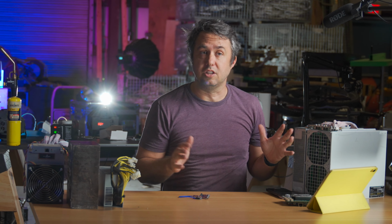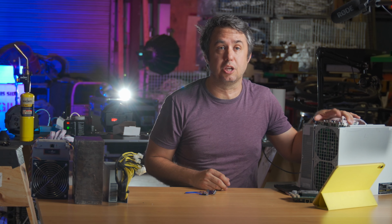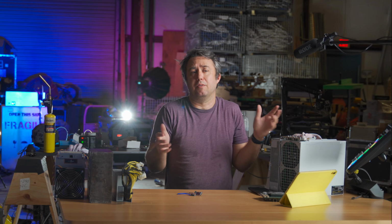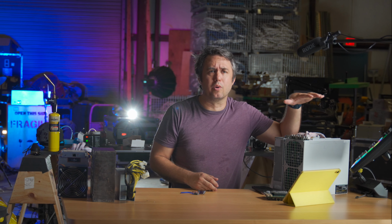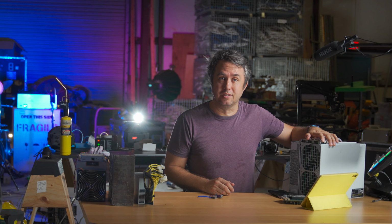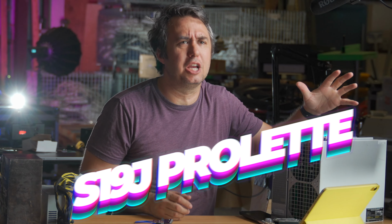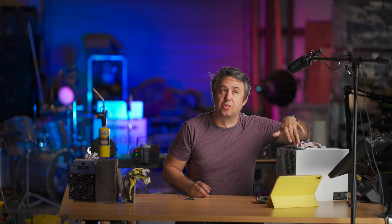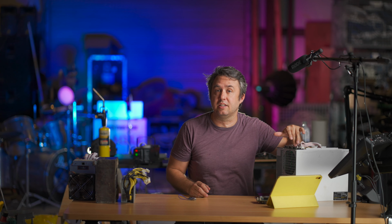1, more watts than you need for 1/3 of an S19j Pro to run, and also less watts than will pop a breaker in a typical 15 amp plug at your house. A perfect recipe for smaller, quieter, cooler running mini S19j Pros. Call it the S19j Prolit. And we did confirm that when you use one of these little things, your miner will still run at the same efficiency. So you're legit able to run basically a 1000 watt 34 terahash S19j Pro. You can still underclock them, you can still overclock them, though that gets a bit more complicated.